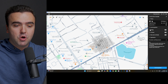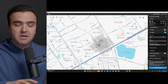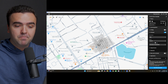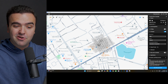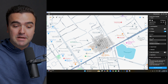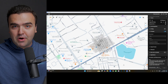On the right side, choose what you want the software to process. For this case we're processing a 3D model, not a 2D map — select that toggle. If you did want a 2D map you could do both from the same set of images. You can choose resolution: high, medium, or low. You can also choose the scene type — normal, circle, or power lines; for this use case I'll do normal. Choose any output formats you might want, then once 3D model is selected, tap start reconstruction in the bottom right corner, go over the checklist, and press okay. Now it's up to the software to process the model.